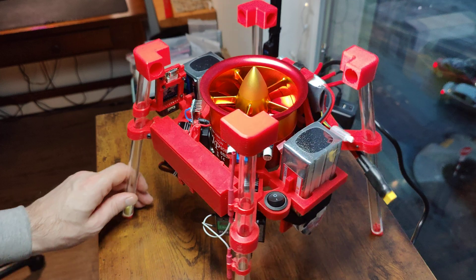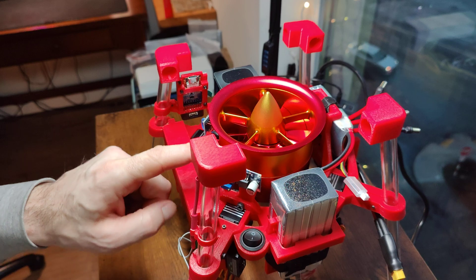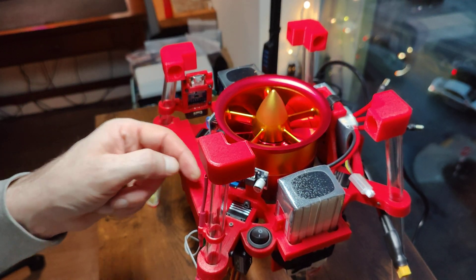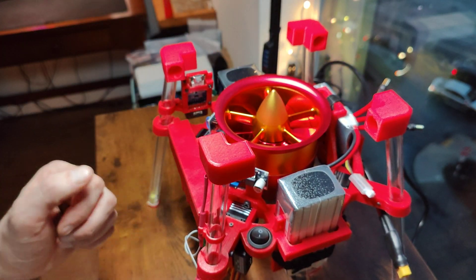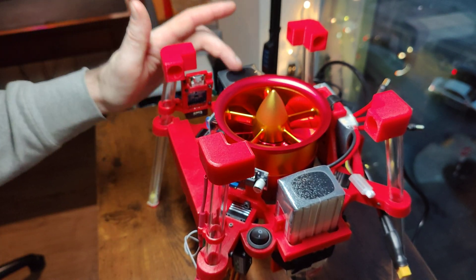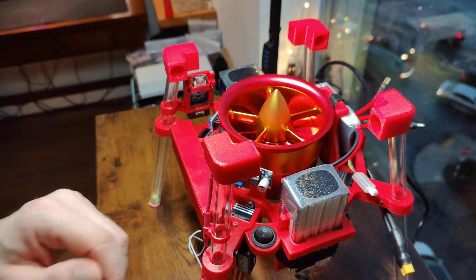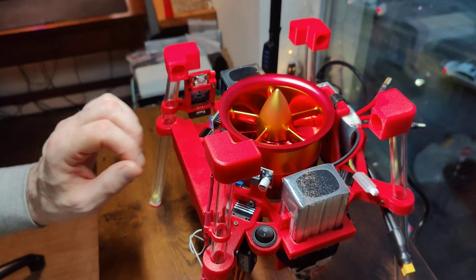This is the buck converter. It's adjustable, but only because I couldn't find one that could bring 24 volts down to 5. At the time, I was planning on using the buck converter off of the 6S batteries. I ended up switching my plan to using a 2S battery for the circuitry and servos. I'm going to tune this to put out 5 volts from the 8.4 volts of the 2S battery, and superglue this little adjustable knob so I don't want it moving around while I'm in flight.